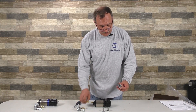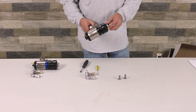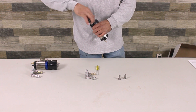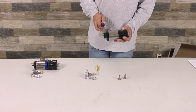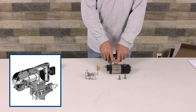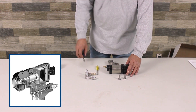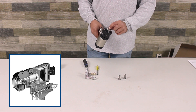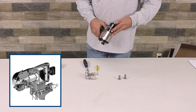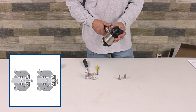The air cap has four holes. This is called the air purge. Air comes in the gun — the two holes make the piston go backwards and forward, and the third hole comes at an angle which pressurizes this with air. Air comes around this and around the tip. When you pull the trigger, the piston goes back into the gun and air comes around here — that's what keeps the gun tip clean.